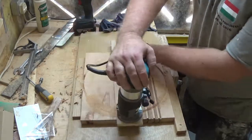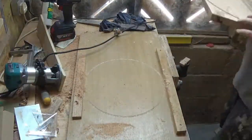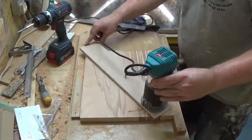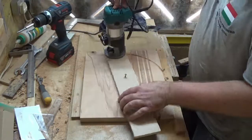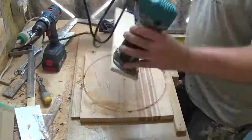Once I was happy I was creating a circle I could then put my hardwood clock face on the board, clamp it in using a couple of bits of wood, and get to cutting with the router. Taking small passes so I don't try to take too much material all in one go, then flipping it over halfway through to get the full depth. Once that's complete, I just move the offcuts and I've got a circle.